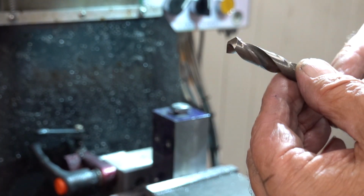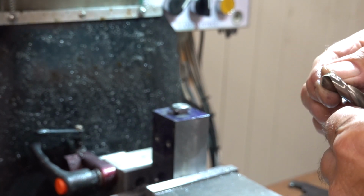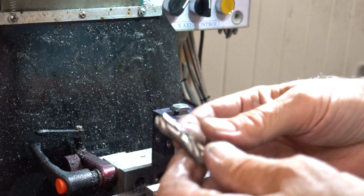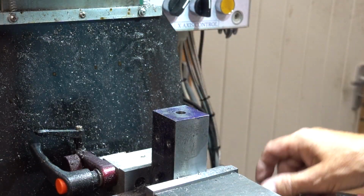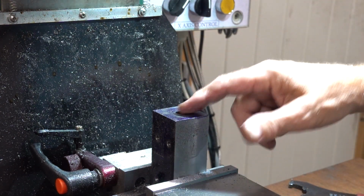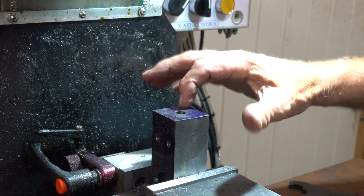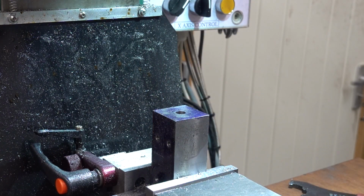So, yeah, these are them drills. I think I got these from RDG Tools, and they've been quite good, these drill bits. That's just bored out way through there, no trouble. I didn't go straight through. I went through with a 6.5 long series bit that I had. Okay, just thought I'd show that. So next thing is 2 holes to pin it together and bolt it together. Again, I shall come back when we get somewhere closer.